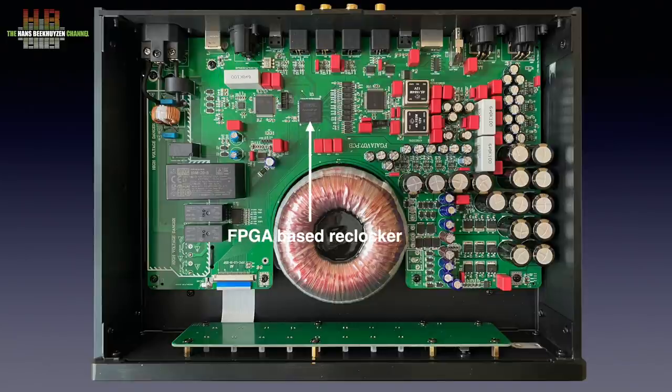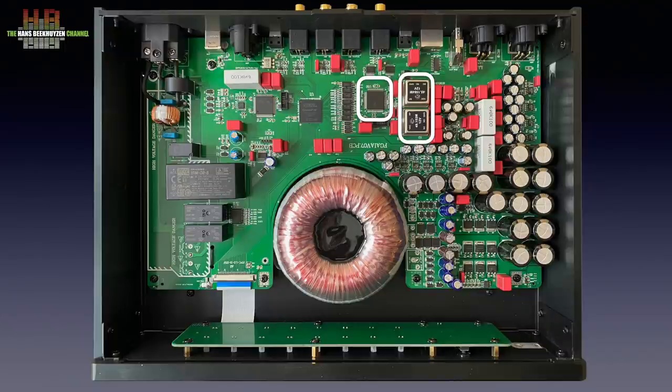Next to the transformer is the multistage linear power supply. The USB input is handled by an SMSC USB hub and a Cortex M4-based microprocessor — a Denafrips proprietary solution. The signal is then sent to an Altera Cyclone 4 FPGA programmed as an adaptive FIFO buffer to do the re-clocking, then through a bank of silicon dioxide high-speed isolation barriers with isolated power supply. On the other side, an Altera Max 2 microprocessor processes and distributes the digital data to the interface chips for each output, positioned closest to the two very high-spec oven-controlled crystal oscillators.